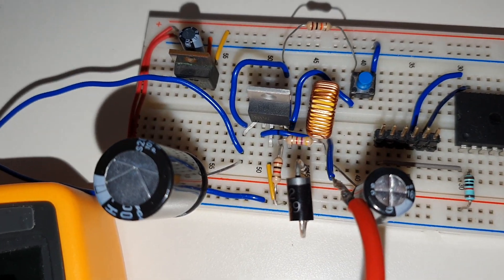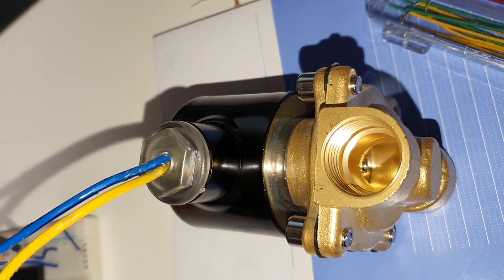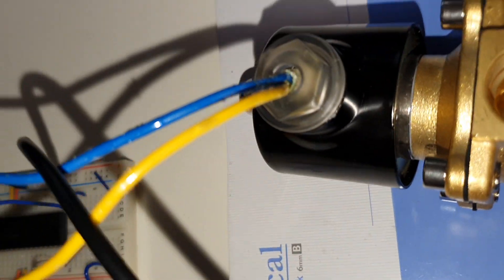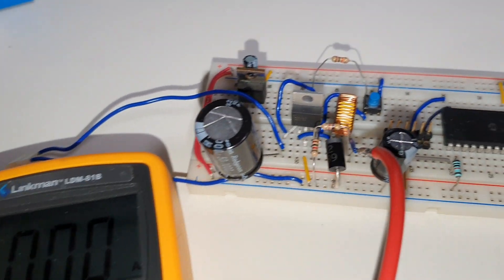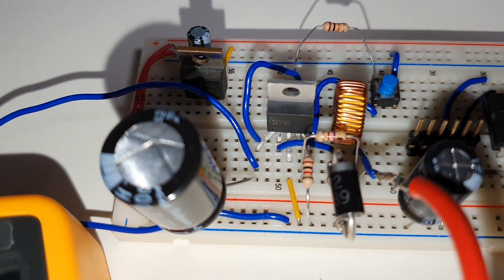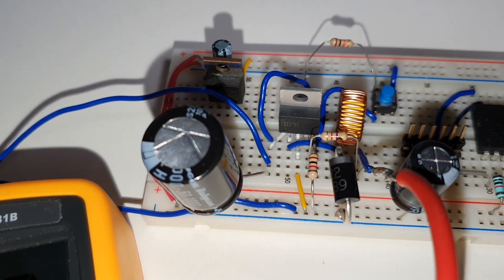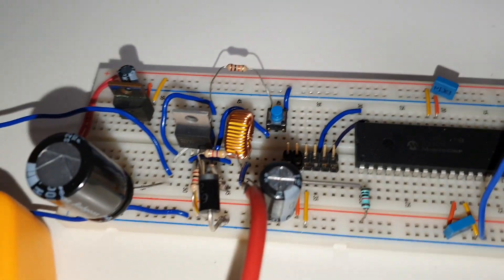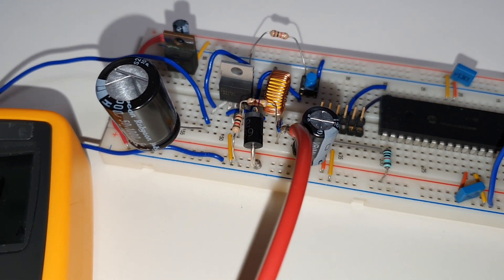You can see these two resistors - they control the variable voltage output. I've got this set up to give about 7 volts. The specification for the solenoid is 12 volts, but the reseller said from their testing it could actuate down to 6 volts, so I gave it a little extra at 7 volts. That means we can actuate and hold it open with less current draw. Now I want to look at the thermal characteristics - the LM2596 is going to get warm and toasty, and the diode probably will too. I'll run it for a bit and put a temperature probe on it.